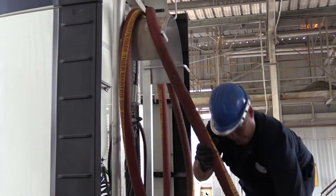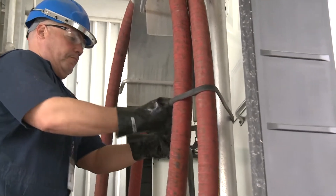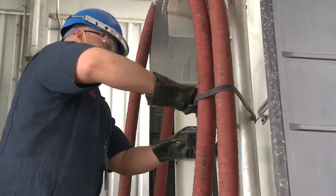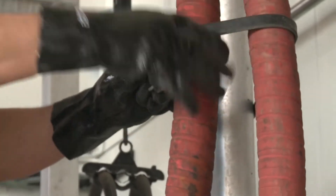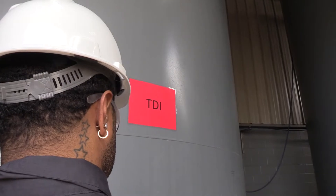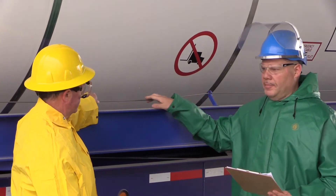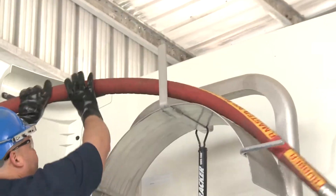Because TDI reacts with moisture, it's extremely important that the hoses are dry. If there is any possibility of a problem with the hose, set the hose aside, tag it, and get another hose to complete the transfer. All these checks in this example process may seem unnecessary because the operation is routine. But taking these precautions every time will help prevent product contamination and a potential overflow.